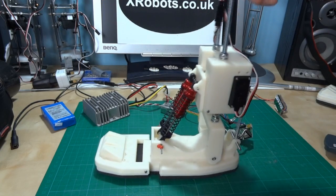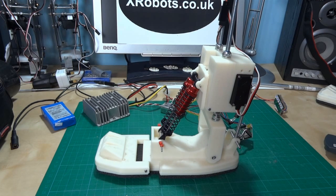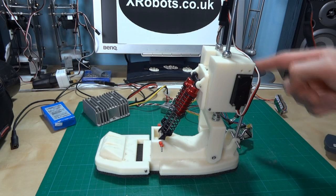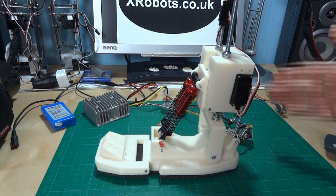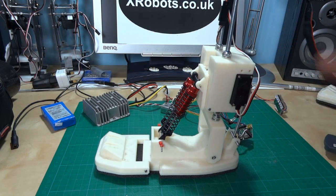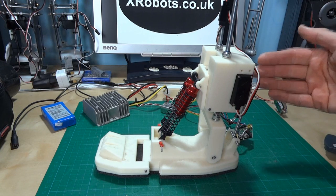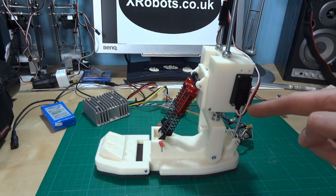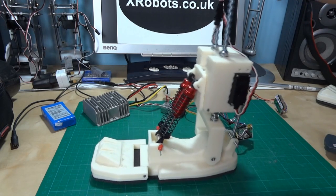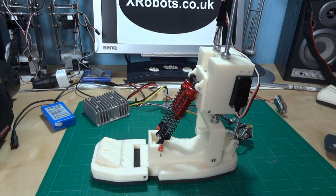How that will work in practice with the whole Android on top remains to be seen, but that's the theory. I can still feed a servo signal to offset it, so if it doesn't move enough I can make the motion greater, and I can also turn up the sensitivity further — it goes a lot more sensitive than that. There are a lot of parameters we can tweak when the Android's in motion, as well as manually controlling the servo and still having the gyro compensate. That's basically how Android 11 worked, with five gyros on five servos to balance left to right. This one will do it to the left and right and to the front and back on each joint as well. Hopefully with a combination of that it should stand up stably and always remain upright and balanced as it walks.